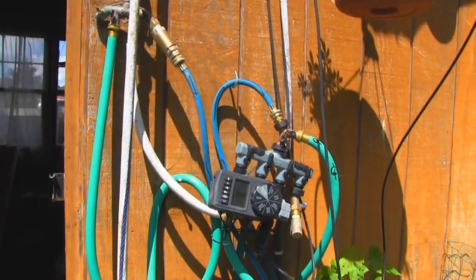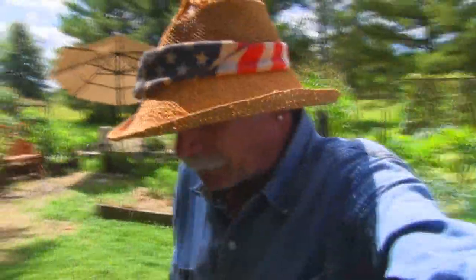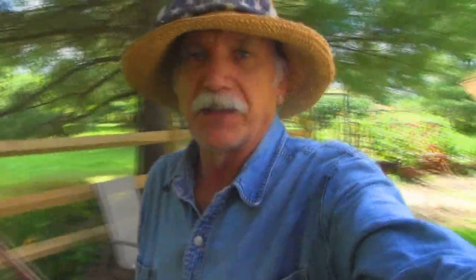That's pretty much how it's all put together. Basically it's a pressure booster tied to a pressure sensor switch, which allows the pump to only come on when it's required — and that's basically whenever the sprinklers turn on, because that's the only thing that draws pressure from this essentially closed system. Now I'll show you how it works when the sprinklers come on — you'll see the pump kick in, then I'll turn the sprinkler off and you'll see it drop back out again.